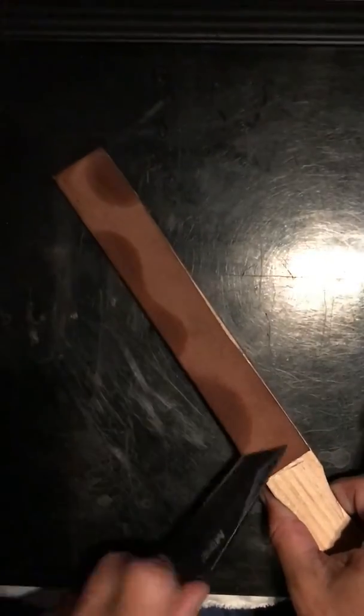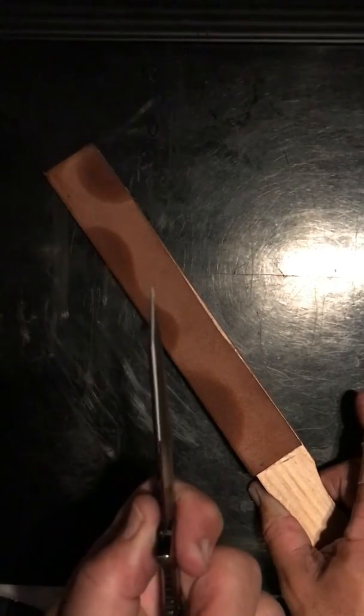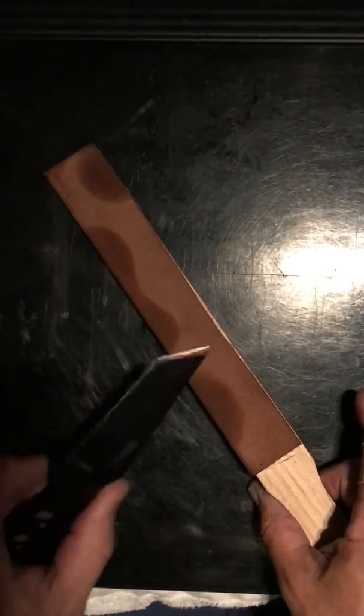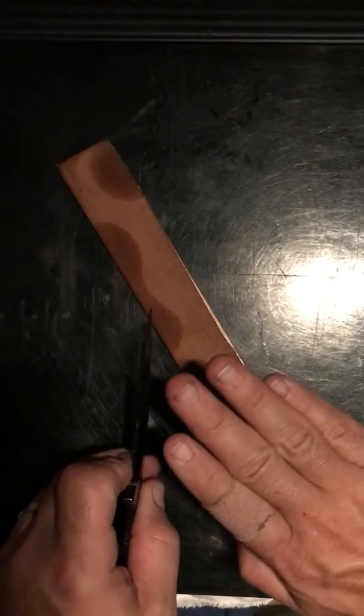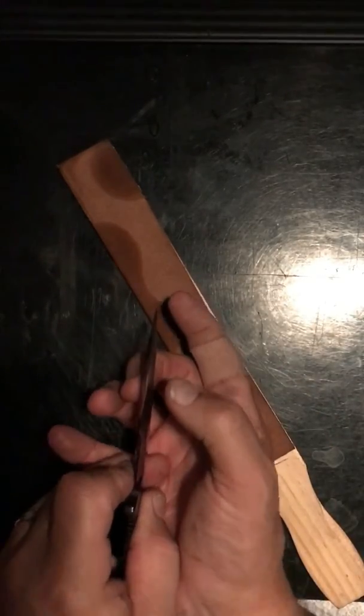But as that metal on that cutting edge gets thinner and thinner, of course it's a thinner edge, which means it's easier to bend, fold over, or make dull. So there's a trade-off between a steep knife edge, which is durable, but not super sharp, and a really thin edge, which is super sharp, but not as durable because it's easy to bend over, it's so thin.